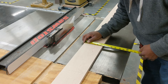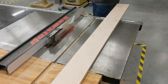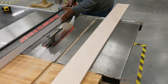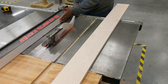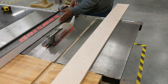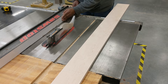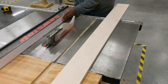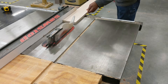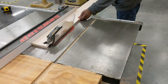I'm going to measure the board to see how much wood I can get out of it, then set the fence on the table saw. You've got to give the fence a little tap-tap to get the line right where I want it. One of the benefits of doing this at work is access to a really beautiful table saw — I can get really square boards and really nice cuts. I think my next major investment for the channel might be a really nice table saw; it's a good centerpiece for any woodworking shop.